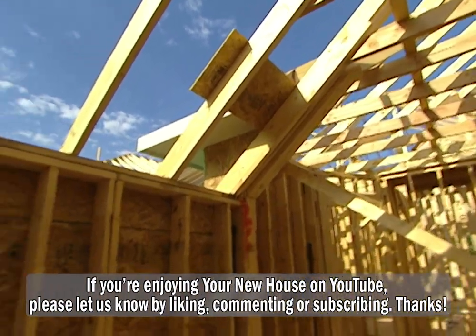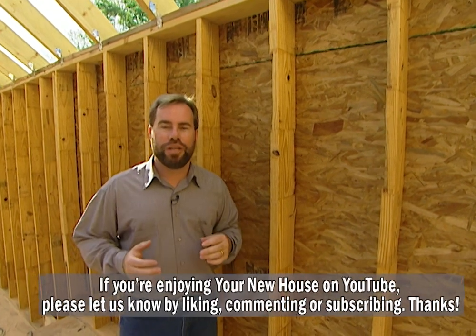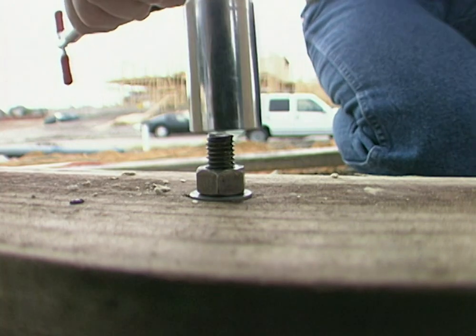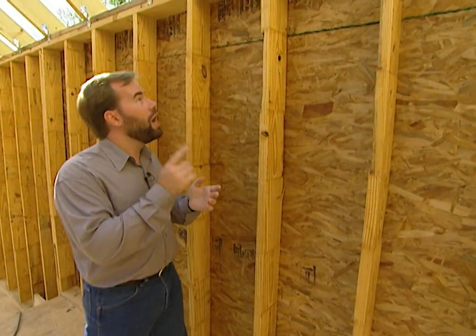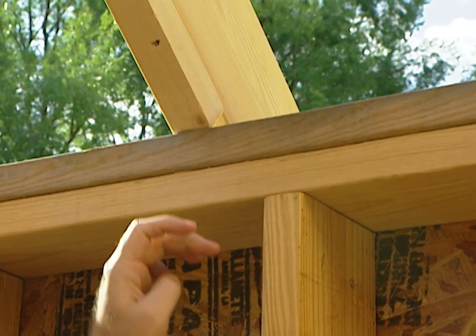It's been a couple of weeks so we're a lot further along in the framing stage. There are a few things to remember about building a strong house, because your home is always being hit by winds. If it's not built strong you'll start to see drywall crack and nail pops; a really big wind — a tornado or hurricane — could knock it down. We put anchor bolts in the concrete foundation and the framing crew set the walls right on top of those bolts, drilling holes in the bottom plate, then adding a washer and nut for a secure fitting. Up top, a lot of builders just put a nail on each side of the rafter into the top plate, but the problem is wind can pull it out like a giant hammer — hitting the side of the house, coming up and taking the roof right off.